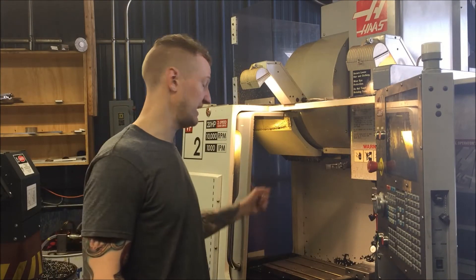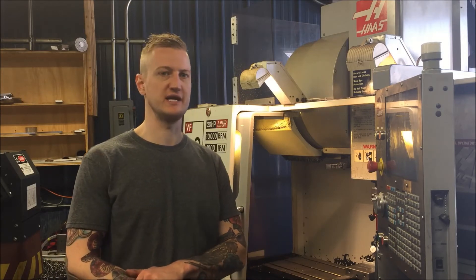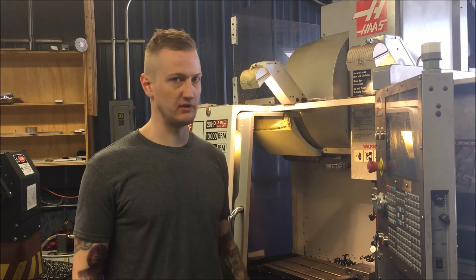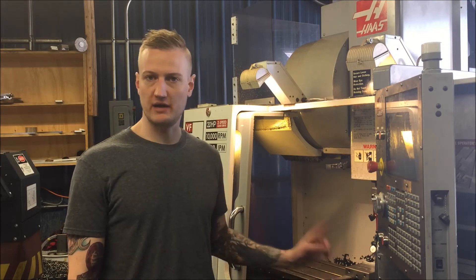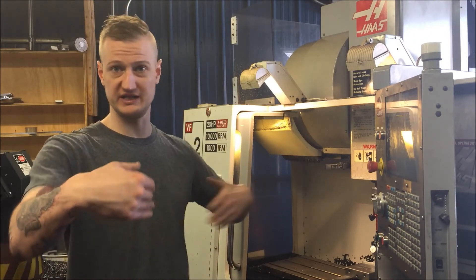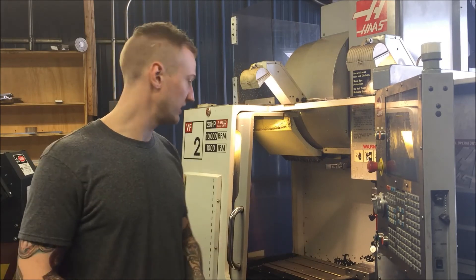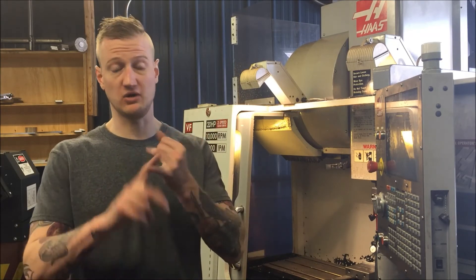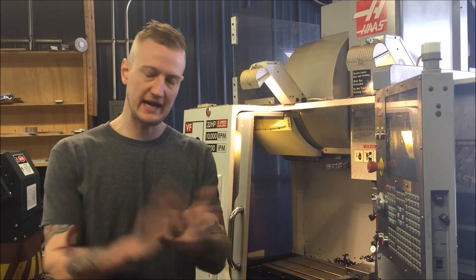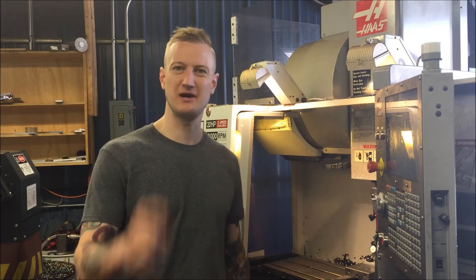That's a quick and easy way to indicate a vise inside a vertical mill. As you do it more frequently you'll get way better at it — when I first started, indicating a vise could take me 20 minutes; now it takes about one. Your accuracy also depends on how straight the ways are in your machine — if you've crashed your machine, the ways may be off. Also, if your indicator stand has wobble it may not be as accurate. Always indicate a ground jaw or one you've machined yourself, and only ever indicate the solid jaw. Thanks for hanging out — like and subscribe if you want to see more!